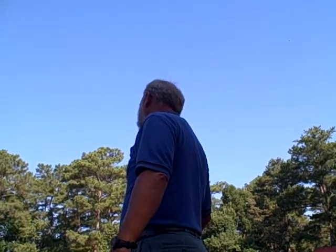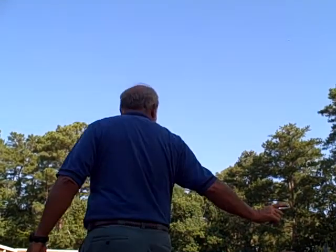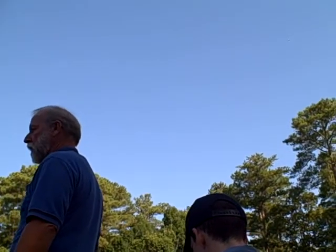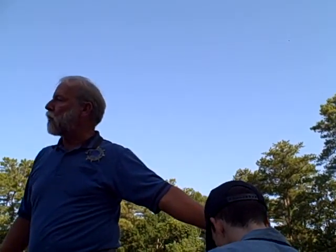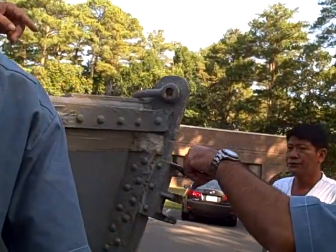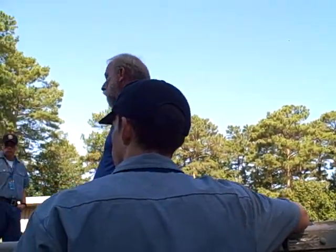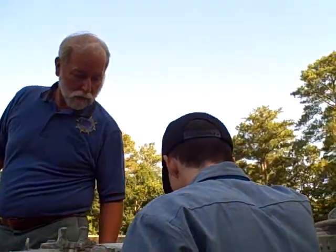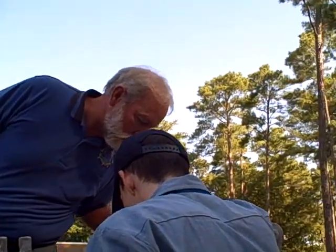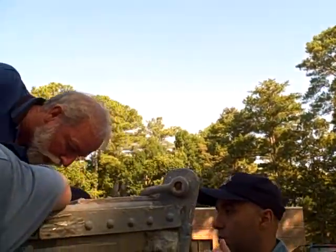Our propeller is missing. You see our three rows of plating on the side, sheer, bilge and garboard strake. You see the keel, the stem and stern post. All the construction we talked about yesterday is here. So this unbalanced rudder? Yeah. Most of those are wooden. If you look on the back, it's got the gudgeons to support it, but it's not in the boat. Is this the gunwale? That's a gunnel. Water would be coming out of that right there? Hopefully not. But I mean, you're talking about the packing gland? Yeah. That's where it would be dripping, right there at that little connection.